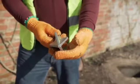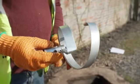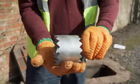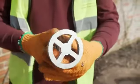The boring tool is used for breaking up and loosening sand and silt in the drain so that it can be easily washed away. The auger root cutter is used for cutting through roots that obstruct the pipe. The crown root cutter is used for cutting and breaking up silt and fibrous roots. The silt breaker is used for breaking up accumulated masses of silt and sand deposits.